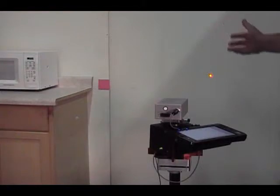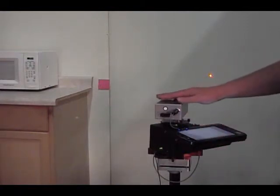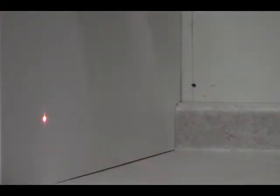It takes 50 points in a third of a second. It could give you a bad measurement. So always wait until after the light comes back on and the beep goes off, and then move the laser like that. Now we're going to talk a little bit about how reflection can cause a bad measurement. Knowing this will help you eliminate it in the future.